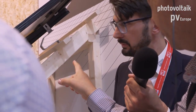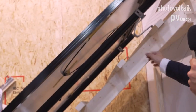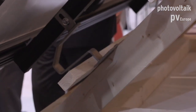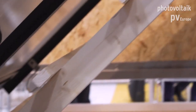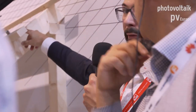The brackets are designed for the standard batten sizes. In Europe the standard is between 60 and 80 millimeters wide. We have different roof hooks — some are higher than this one — so we can accommodate all the different shapes.